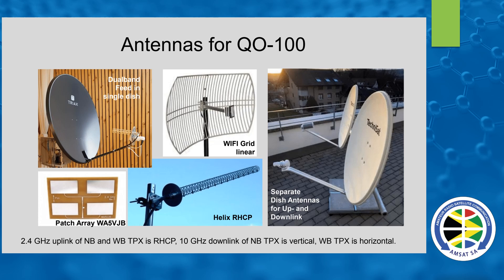Even the helix — right hand circular polarization of course, in this case, if you want to go narrowband — and it works. I speak to a couple of guys through the satellite just running one of these helixes. And you don't need a lot of power, that's another nice thing. I run a big dish, about a 2.4 meter, and another one, a 1.8 meter for narrowband, and I run maybe half a watt, sometimes a watt output, and that's more than enough to get a signal equivalent in strength to the beacon.